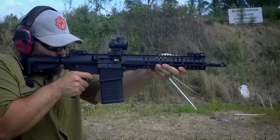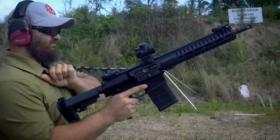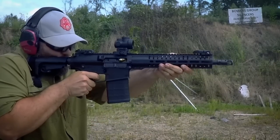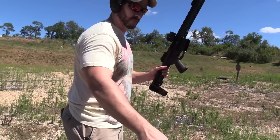I'm going to guess what's happening is it's over-gassed — it's hitting the deflector, and instead of sending the brass forward, it's sending it back into the action. The bolt's catching it and getting crushed, consistently the same exact problem. So that's our issue. It's funny because that gun was the epitome of reliability for today.